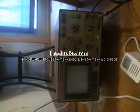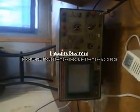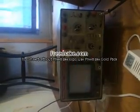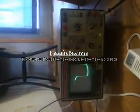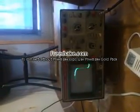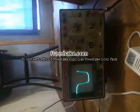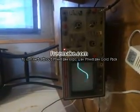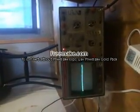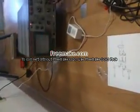As you see there, I trim it, and see how it went to there, and it looks almost like a square wave, like a curved square wave, for example. That's because the diode effect is occurring. Maybe turn it down just a bit. You can see a sine wave. Now let's try channel 2.